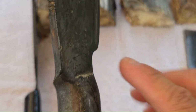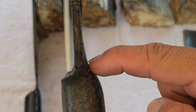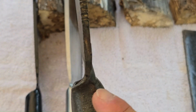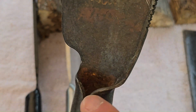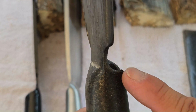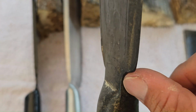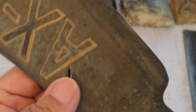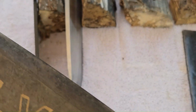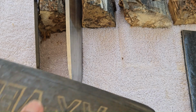So the weakest spot on all these blades is going to be the point where the handle deflects off of the blade. This whole area here, like on this one, right where this groove is, that's going to be the weakest point. But since it has this reinforcement rib caused by making this handle fold, it's very strong. So the top portion is extra strong. The bottom portion, I unfortunately ground that off, right where the crease is. Had I left the crease there, it would go over here, and you'd have a reinforcement channel. I basically ground that reinforcement channel off. So don't do that. My next AX-VEL, I will make the choil further and leave that reinforcement rib there, and I won't have any issues. Not that I had any issues with it, but it is a weak spot, and I noticed it. After I did it, I was like, oh, structurally that was not smart. So that's one thing to consider.